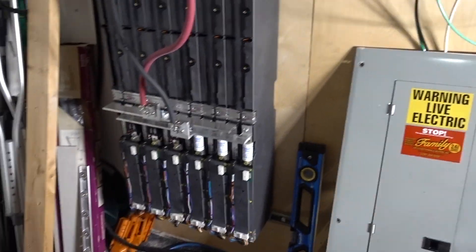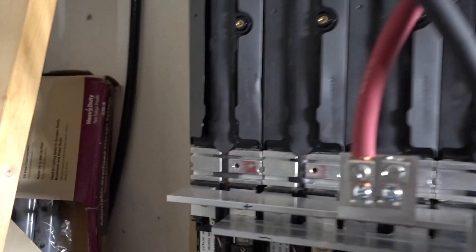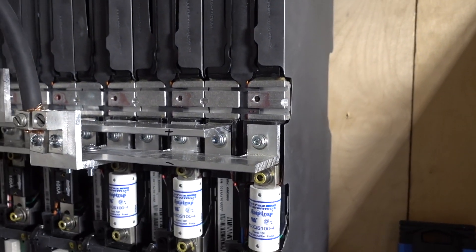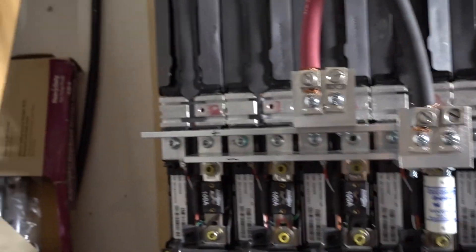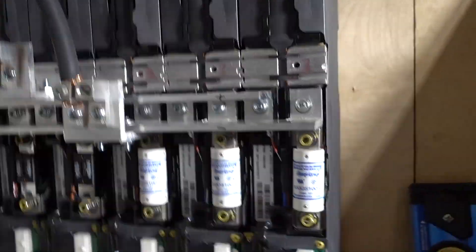All of that is being run off of six Tesla Smart For Two battery modules, all wired in parallel. Those are my bus bars that I made myself — my buddy Jeff has a CNC machine, he put that all into AutoCAD for me. I gave him the dimensions and we used his CNC machine and made these bars; took us a couple of tries but we got it.